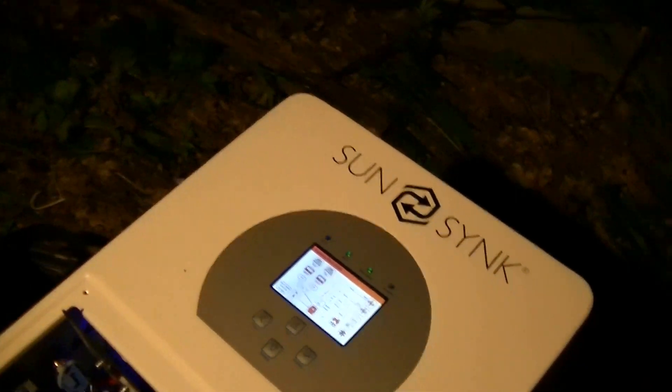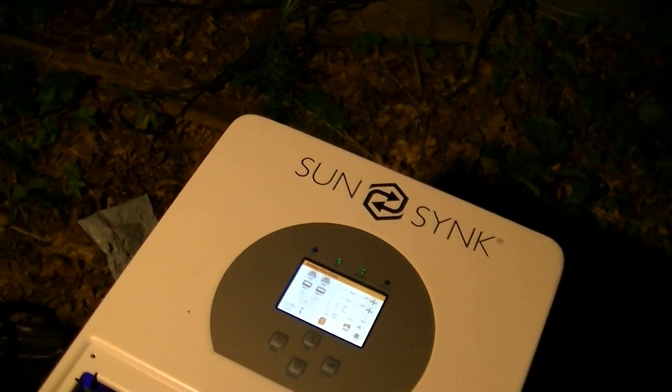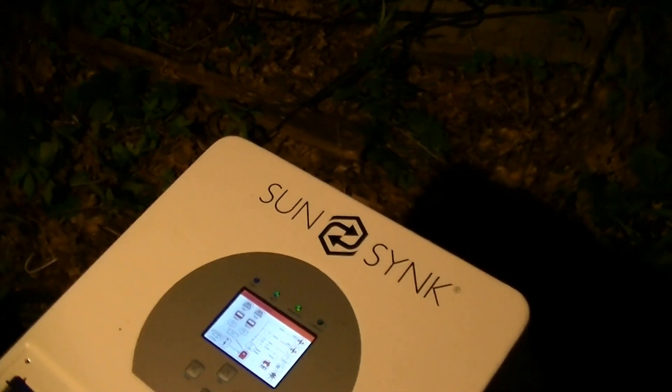What I had to do was, instead of it working off of battery assumed percent state of charge, I switched it to battery operating potential. And that seemed to make the beeping go away.